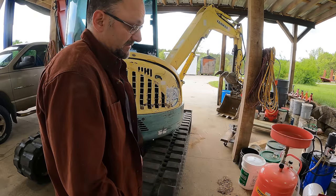So what I want to do now is get a gauge on this so that I can see if I'm getting a bunch of leak down. In other words, I will put it forward, but I'm going to have the track disconnected so that it just deadheads into that pipe. The pressure relief valve will protect everything, so I'll get to maximum pressure, and then I'm going to see how quickly it leaks down. Basically, I'm trying to test for internal leakage within the control valve itself.